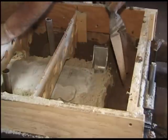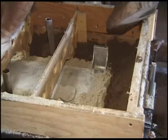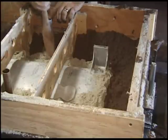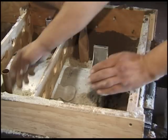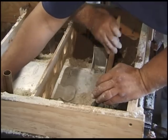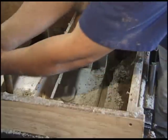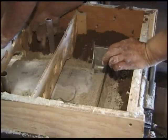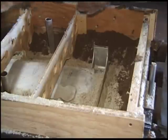Little bit different than the green sand. Yeah, green sand, you gotta really pound it hard to keep going. Coarse sand, you can not be as hard out in the area, but concentrate where the pattern is. So we need about an inch thickness of the white, the new stuff? Facing. It's a better quality sand. It's new sand, so it gives you a little bit of a cleaner surface.